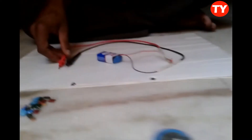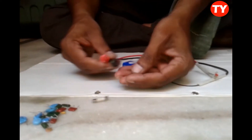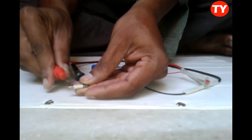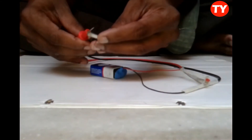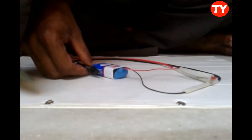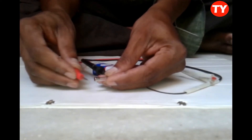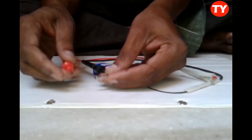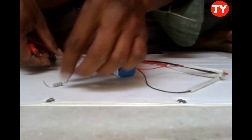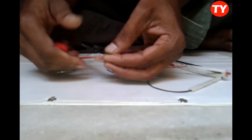First, fuses — I am checking. We have to connect like this. This fuse is okay. If the light does not glow, the fuse is open. If the light glows, the fuse is okay. Here, 22-ohm resistor connected — this is also okay.